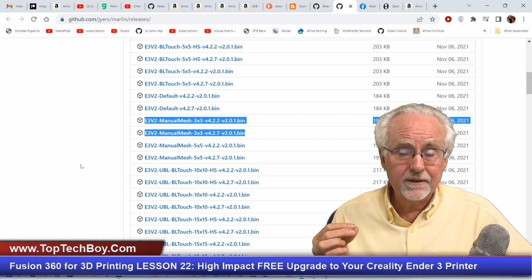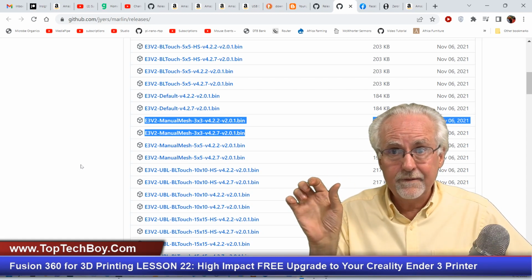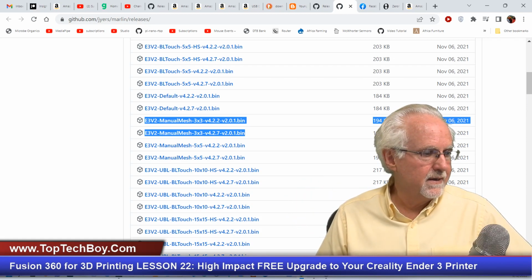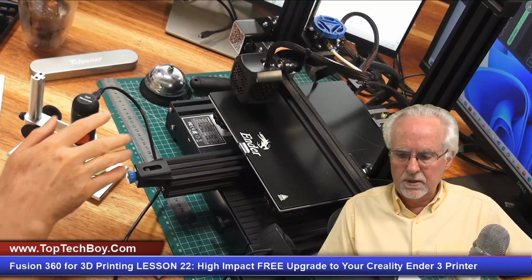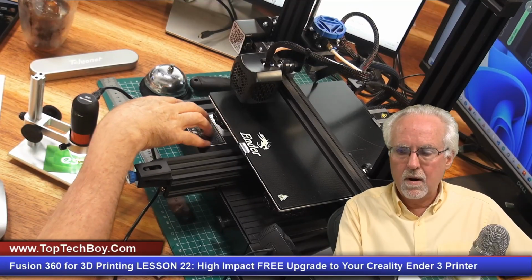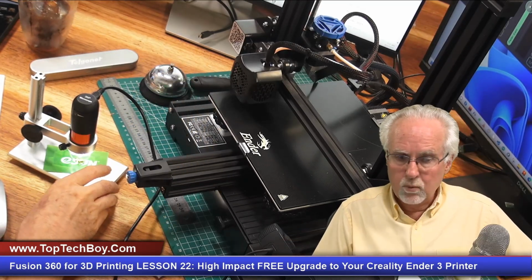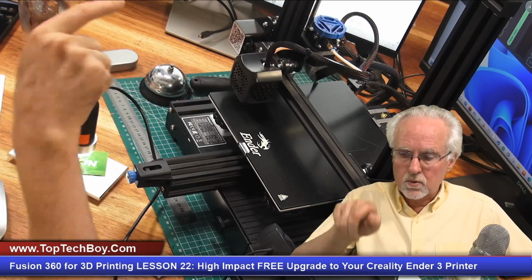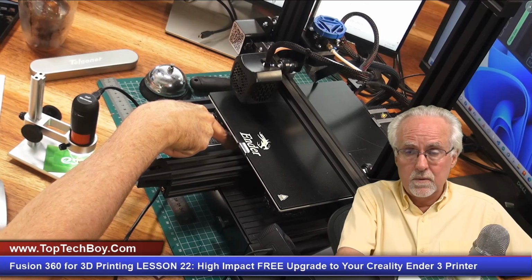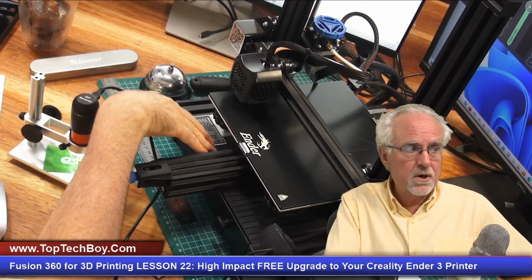Well, unfortunately, Creality did not think that it might be nice out on the outside of the printer to tell you what motherboard you have. So you're going to have to dig into this. What I will show you is the motherboard is underneath the left part of the printer. There is one screw right here on the top. You have to take that screw off, and then on the bottom there are 2 or 3 screws over in this region.